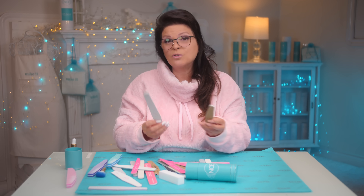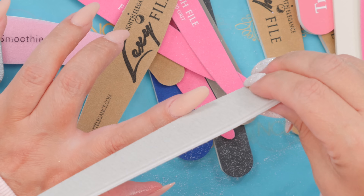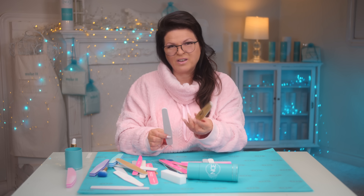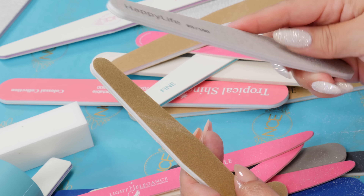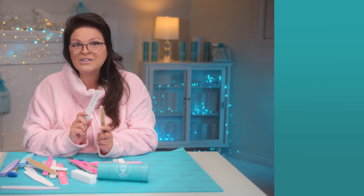Files aren't so scary once you know what to use them for. Another tip: when you buy new files, score the edge. A brand new file can have a rough, sharp edge that can cut your fingers — especially when you dig right in there. So take another file and rub it along one edge, just once or twice. Make sure you do it on both ends, then flip it and do the other side. That'll save you from cutting yourself or anybody else when you go to use a fresh file. They can last a long time too — if you want to know how to take care of your files, check that other video out.